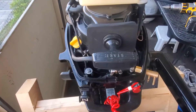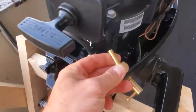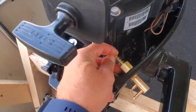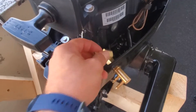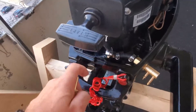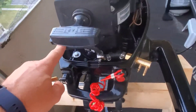One of the other challenges I dealt with: this coupling was originally about an inch and a quarter long. I cut two grooves off because otherwise the gas line would be too close to the engine. Right now, as you see, there is a little bit of space in between. This heats up as you use the motor, but I believe it's safe enough. I'm going to check it out before I use it for a long run.